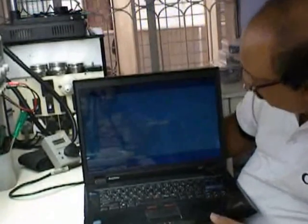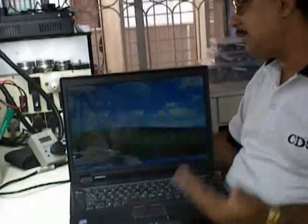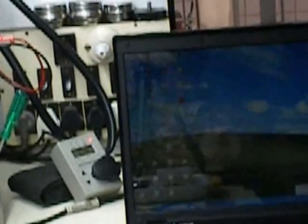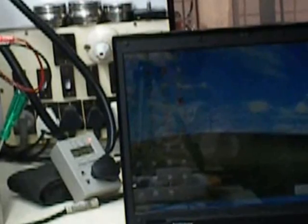Now, as soon as the window comes out, you will find the reading becomes a bit more stable. And suppose you are using some graphical utilities or something, again the wattage increases. Now you can see approximately, once the window comes out, the wattage is around 32 watt. And as soon as the loading stops, the wattage decreases again.